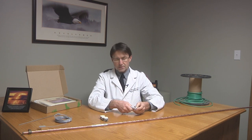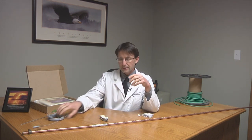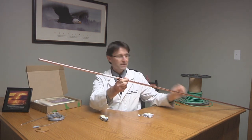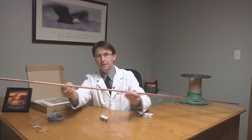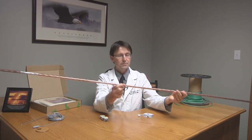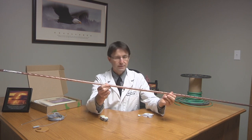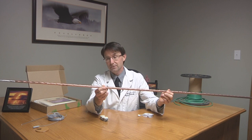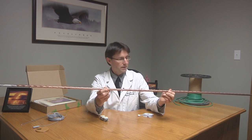Let's start at when your house is being built — the electrician is going to ground your electrical system. How they do that is there's usually a copper rod like this. It's eight or nine feet long — you can see how long that is. What they will do is drive this into the ground, into the earth, out by your electrical outside disconnect and meter.